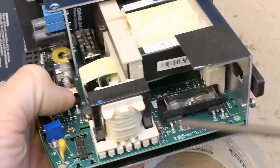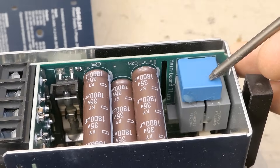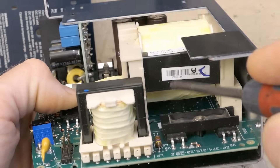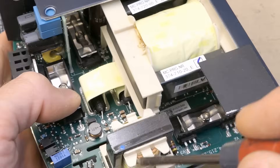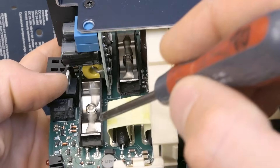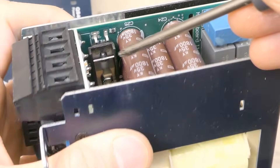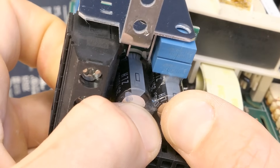Let's figure out how this works. The input voltage of about 400 volts goes into this half bridge, switched into the transformer primary. There's also a resonant capacitor or capacitive divider making the center point for the half bridge. These capacitors could also be resonant — it could be a resonant power supply, as there is no output inductor. There is an inductor on the primary side in series with the primary. This inductor goes from the center point of the two transistors, then to the primary, then to these capacitors. The secondary is center-tapped, with a synchronous rectifier on the secondary side using low-voltage MOSFETs in parallel pairs. Then it goes to output capacitors — 35 volt ones — which makes sense for a 24 volt output, then to tiny inductors for more ripple suppression, and to a smaller pair of output capacitors, again 35 volts.